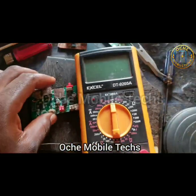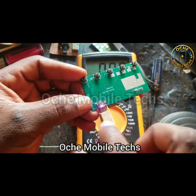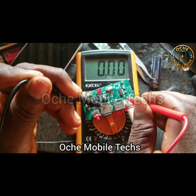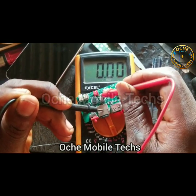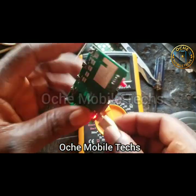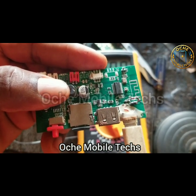I'm done. I'm going to plug in my charger now and take our reading from both sides. You can see it is working — the Bluetooth speaker is turning on. Let's take our reading: you can see 4.50 volts. Now let's read from the battery terminal. You can see 4.46 volts. You can see that it is no longer five volts — it has dropped, and with this it is no longer going to destroy your battery. Thank you so much for watching and see you again in my next video. Bye-bye for now, I love you all.